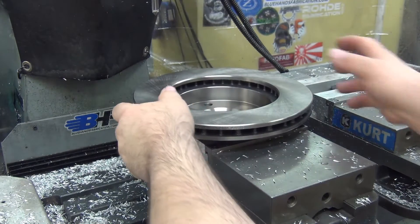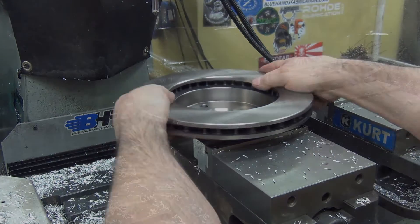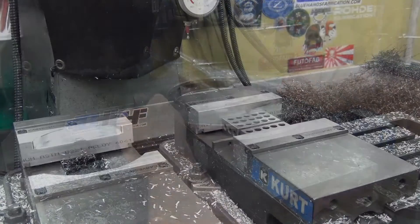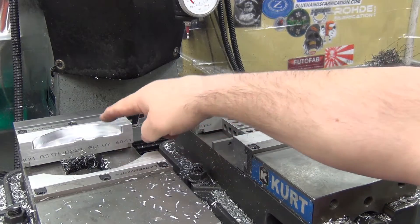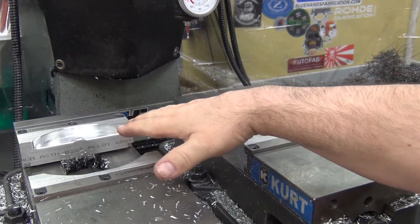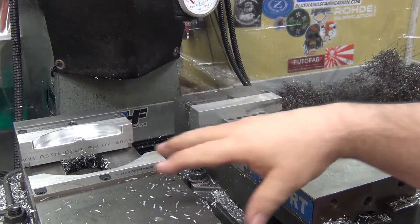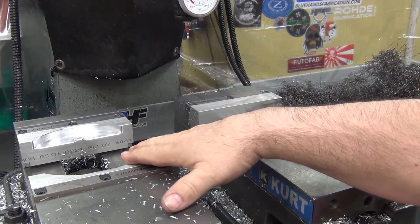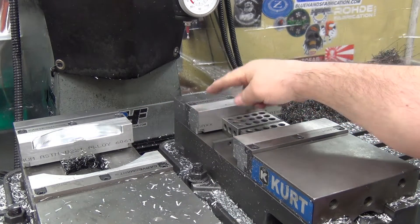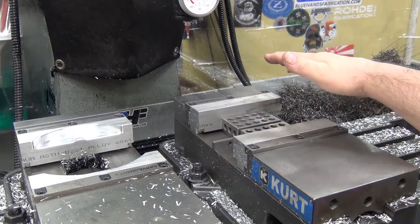The diameter is wrong — that's not very nice. I messed up and cut the diameter wrong all the way back to the art for the rotor, so I fixed all that and had to regenerate it. Not even going to bother trying to resurrect this side. I'm just going to set G54 over here and recut these and should be good to go.